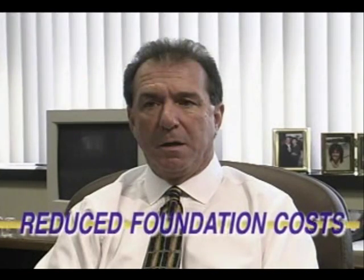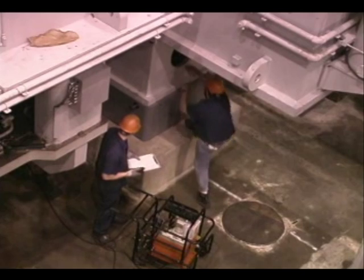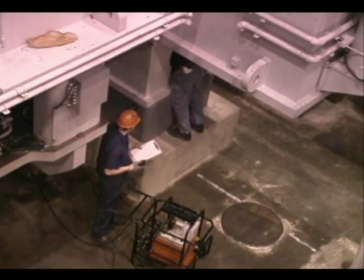They like the systems because once they have them lined up in the location they need to go, then it's a matter of a straight up and down situation: adjust, lock the system out, and it's done. Another factor as far as savings in regards to vibro is the fact that the foundations that are needed to support this equipment have been reduced substantially in lieu of the standard style base plate, individual piers that we've seen in the past. So the foundation's more cost effective using Vibrodynamics.